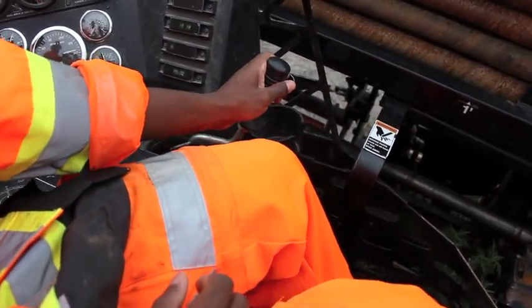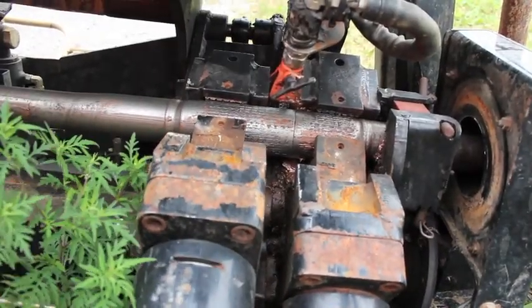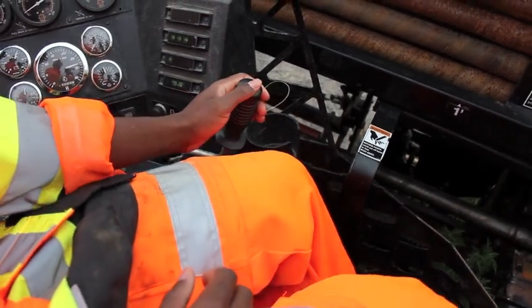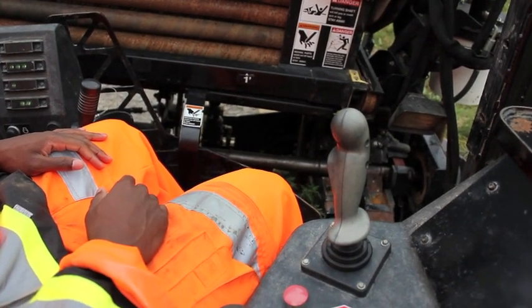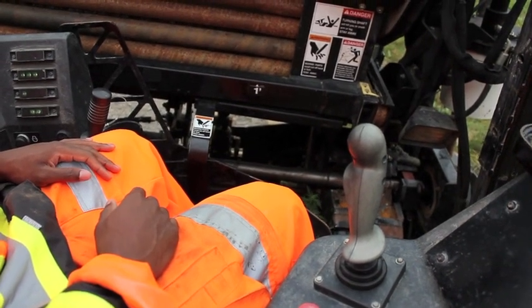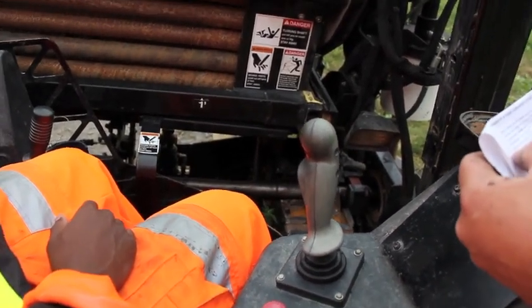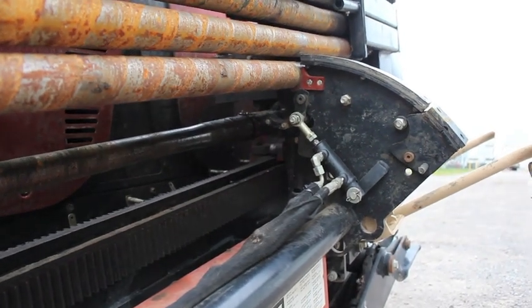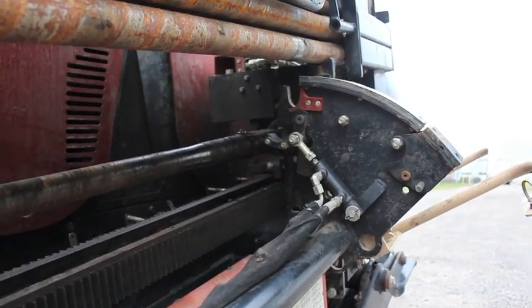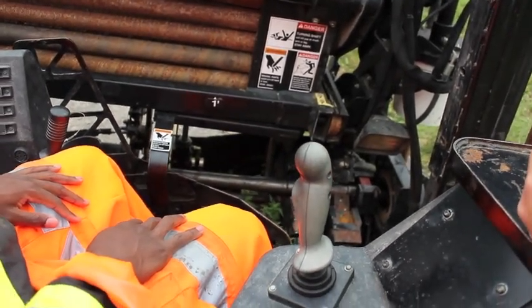You're going to push that forward. Step number one is to ensure that the rod grippers are open, the rod lifters are up, and the shuttle is empty. Right now it's in full position, so ensure that your rod grippers are open. Extend your shuttle arm down to the spindle all the way.